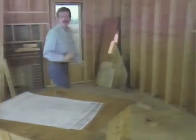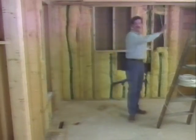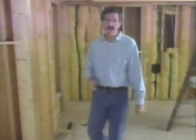For the kitchen and adjoining dining area, code requires 2 20-amp circuits be installed to handle the various appliances. How many circuits are required will be determined by the number of appliances that you're wiring for. If you're in doubt, call your local building department for clarification of the local code.